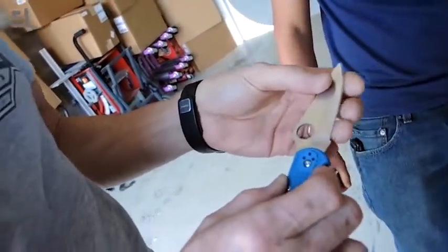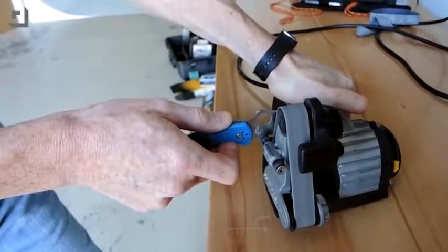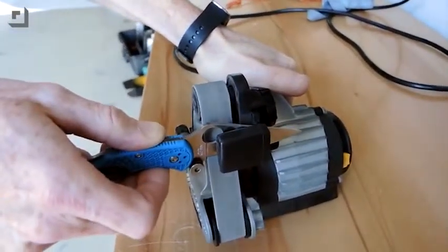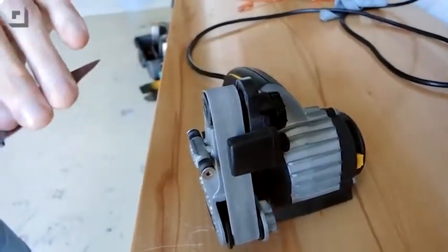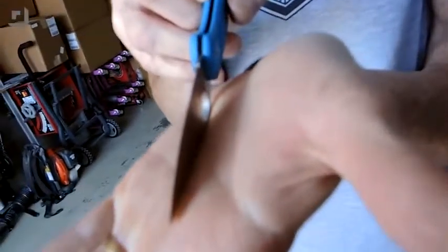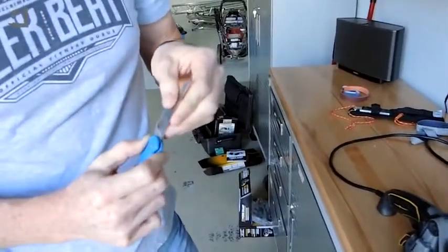Maybe just a little more. Can I try a couple passes? Just be sure when you're pulling it through that the blade is resting up against the guide on each side. Keep it flat on the guide and squeeze the trigger before you pull it through. It already looks different — you can see it seems kind of polished, and it's starting to be rounded on the edge. Let me see if it's shaving sharp yet — let's try and go to another grit.